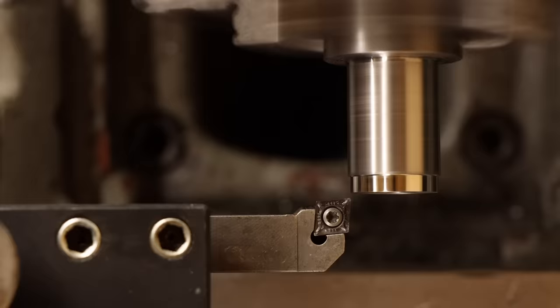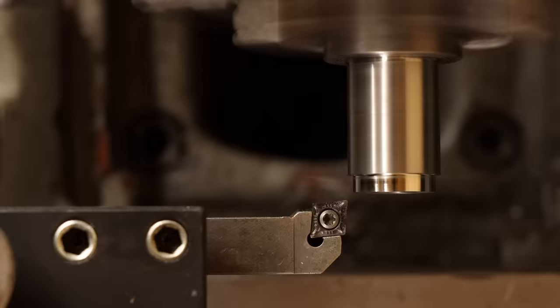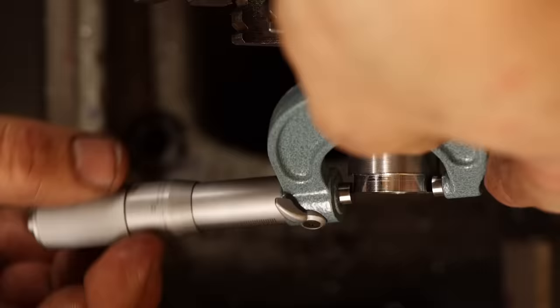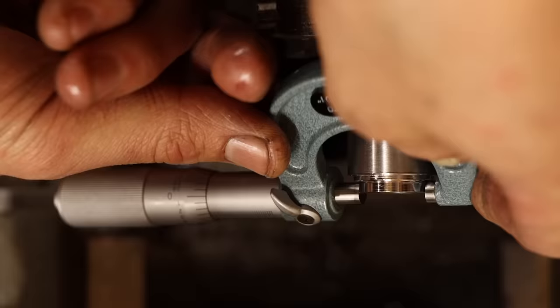Speaking of shaping, time to shape the end of the centering boss, where I've included shallow steps at common diameters to accommodate different slitting saws. These diameters need to be just as precise as the rest of the features if I want them to actually be useful for centering the blades. So again, it's slow and steady here as I bring each one to dimension and length. Then, that's all she wrote. Well, for this side at least.